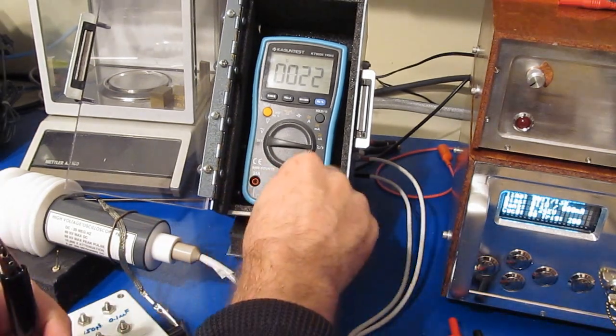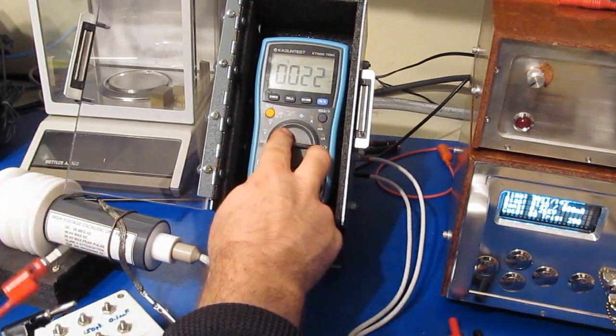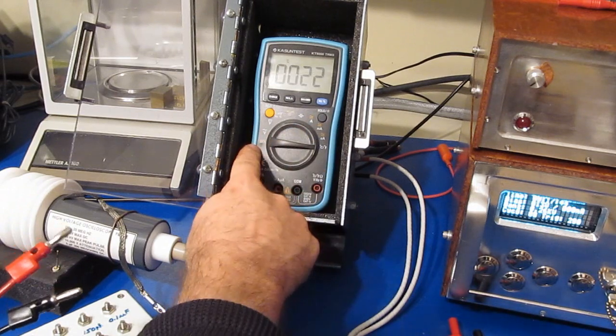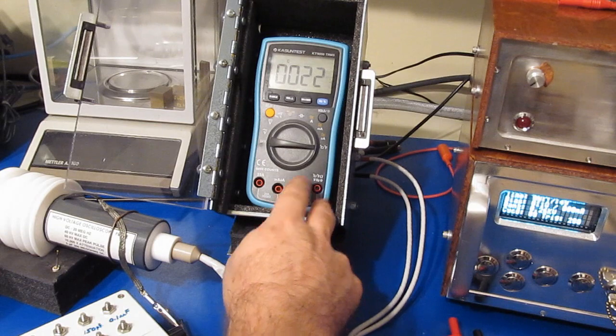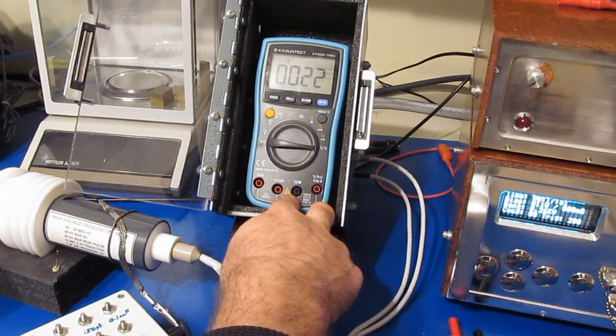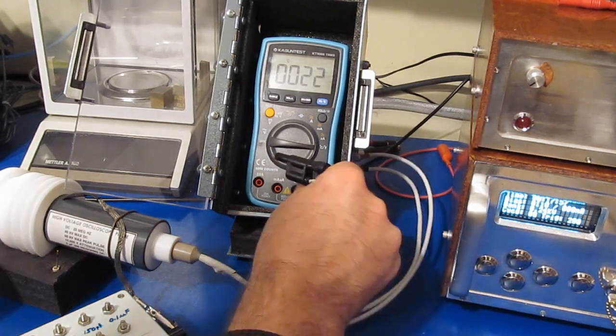Alright, so the meter passes functional just fine. What I was thinking about is when I had this thing hooked up to our ESD gun and it was in the off mode and it enabled that transient protection, I wonder if they're not trying to protect the IC against ESD, although I'm surprised they just wouldn't switch everything out, but maybe it was something like that that they were concerned about.